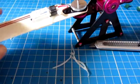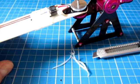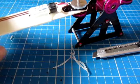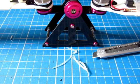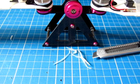The reason for that is that the heat shrink doesn't shrink uniformly because it's hard to get the heat on it uniformly, and because of that, one tightened up at the back first, the other tightened up at the front, so that it moves slightly, so it's positioned on the blade, and the way it actually tightened up was different. So to take that out of the equation and have them balancing perfectly, I had to just keep cutting little fine bits off the heavier blade until they balanced perfectly.